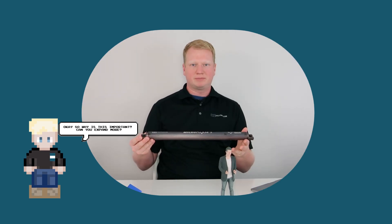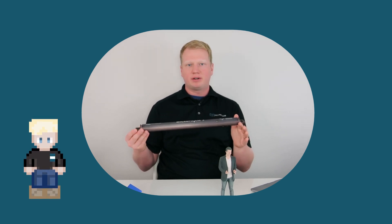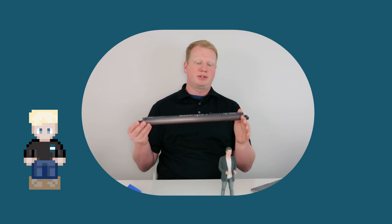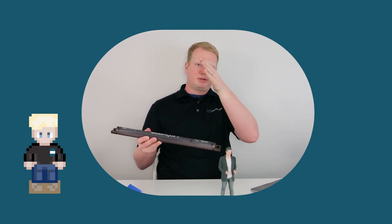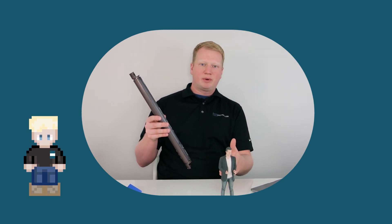What do we do with all this information? Well, to access shale resources or pretty much any modern reservoir, we need to perform directional drilling. And to be able to perform directional drilling, I'm not just drilling a hole straight down — I'm drilling a hole down and out, with curves and all these kinds of things. I have to be able to measure where I went. And so for underground navigation, because we don't have a GPS system or anything else like that, we can do what's called dead reckoning navigation.